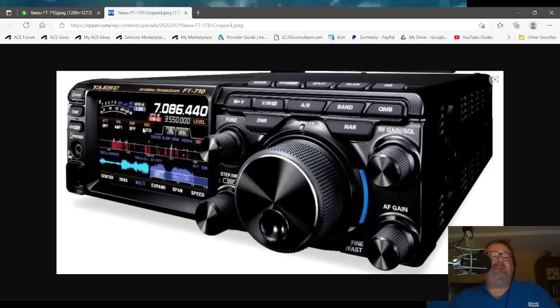So what I'm wondering is: is this a straight SDR? Does it not have a physical roofing filter? Because a software defined radio wouldn't have one. Some of the better quality SDRs will have additional filtering ahead of the SDR stage. Yaesu, with the FT-DX 101D, MP, and the FT-DX-10, introduced what they call the hybrid architecture — which had the benefit of a dual superheterodyne receiver with all its selectivity and no front-end overload issues — and then it would feed the SDR stage. Maybe it's dual conversion with just one 15 kHz wide roofing filter like the FT-891, relying on the DSP to do the rest of the filtering.